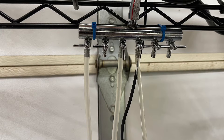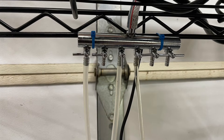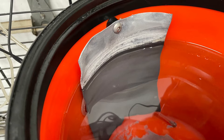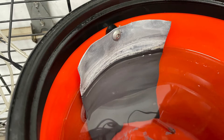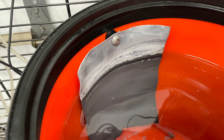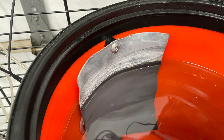Air is also really important in the anodizing process — it agitates the bath, evens out temperature differentials in the tank, and this valve just allows me to plumb air wherever I need it. Here's the inside of the tank. I've got a lead plate connected to stainless hardware through the bucket so I can connect the lead to the outside. At the bottom right there's a hose with a quarter-20 stainless fastener as a weight holding it down — there are definitely better options, but it's been working fine.